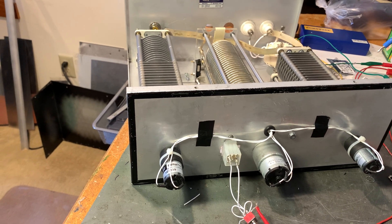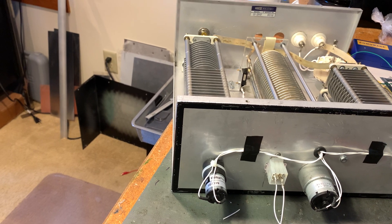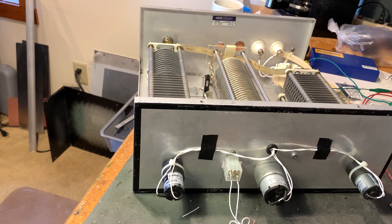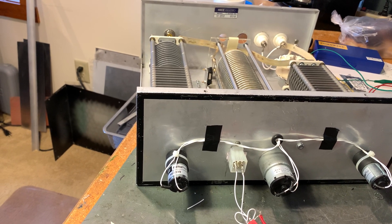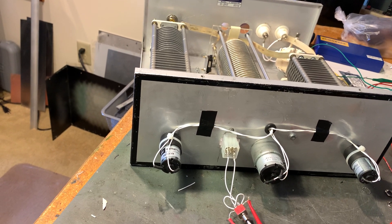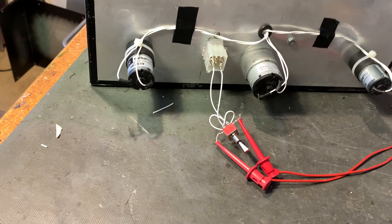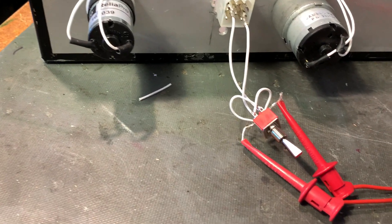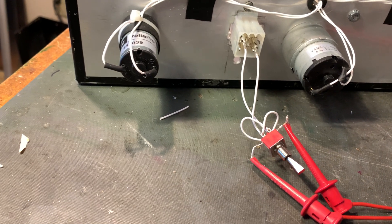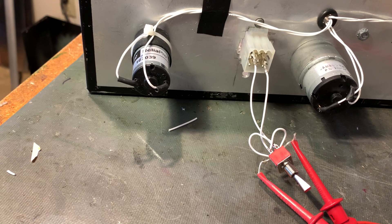The motor on the left is the transmitter tune, on the right is the antenna tune, and in the center is for the roller inductor. I've got a Molex connector to control everything. Since I don't have the controller unit built yet, I built this little switch arrangement that I can just pop into the Molex connector, which allows me to drive the motors forward and reverse.